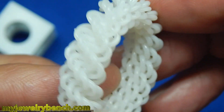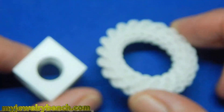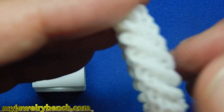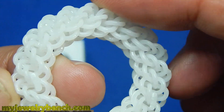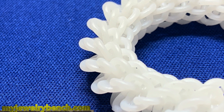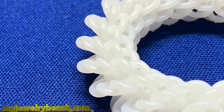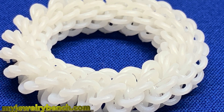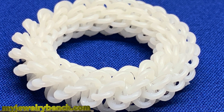So that's my firmware update. I don't think I'm getting much better results overall, except for the curved surfaces, which are printing much, much better. I can't wait to print some jewelry with this — stay tuned because I'll be doing that in the next week or two. Here's a closer look at the knotted torus that I printed — it printed really well. You can see there's very good detail, and I'm getting very few resin lines even at 0.05. I could have dropped this down to 0.025 to see what it did; it would have taken a little longer to print, but no big deal.